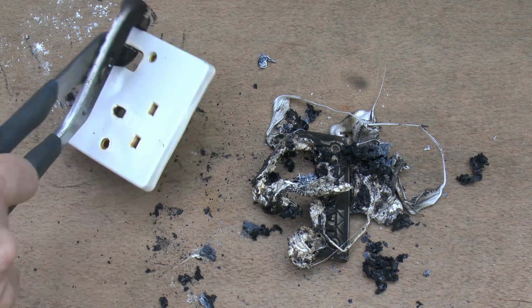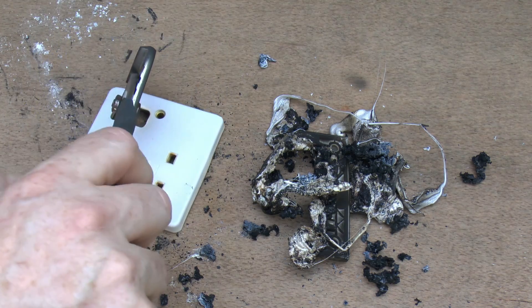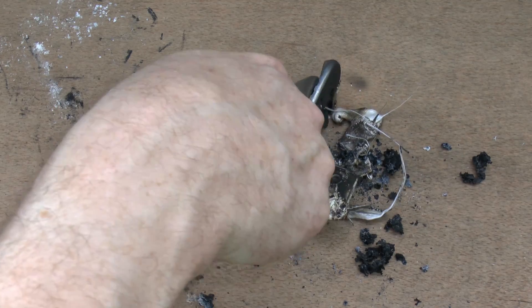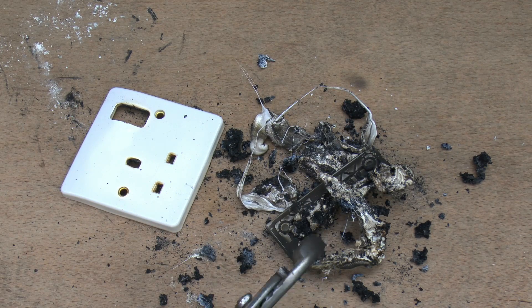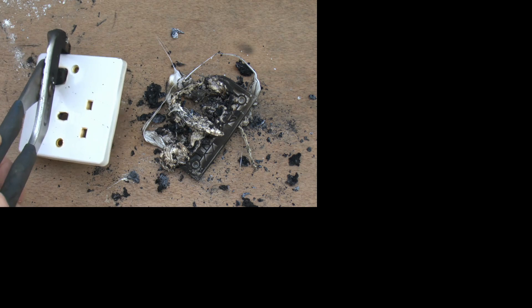Here's what's left at the end. The thermoset one is quite blackened and charred on the back with some cracking of the material, but structurally still fully intact — it hasn't disintegrated and the front looks pretty much as we started. The thermoplastic on the other hand is a congealed melted mess — a completely different type of material. This is primarily because this type of plastic will melt at high temperature whereas the other kind does not. This is a fairly extreme test, and in normal use whether thermoset or thermoplastic probably won't make a huge difference — but in the case of a fire it's much better to have thermoset materials. This is also why old fuse boxes are made of a similar material — so if they got hot or even caught fire, you didn't get that melting and burning effect. It just contained it within the box. That's it for this video — thanks for watching.